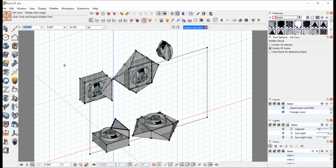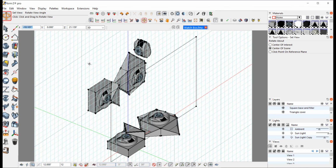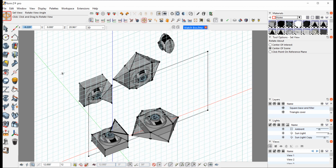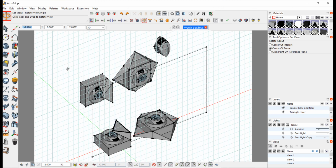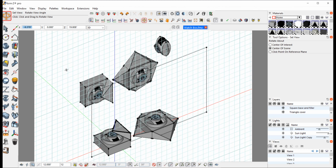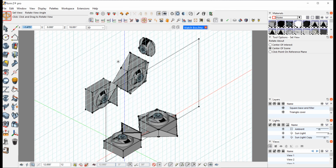So this time, I am not creating a die line. Like I had mentioned for the folding carton and the corrugated, we built the 3D object and then we derived a die line from that. So that's actually a little bit more difficult because we have to figure out how all those components are going to work as a die and as a 3D file. Here, we're just building this by hand. We're going to cut out these pieces and glue them together and assemble this.